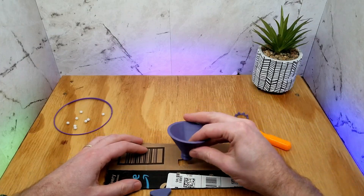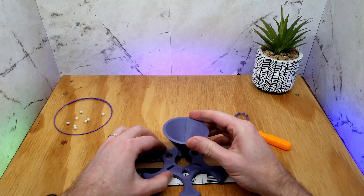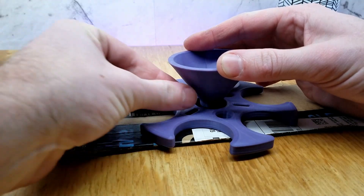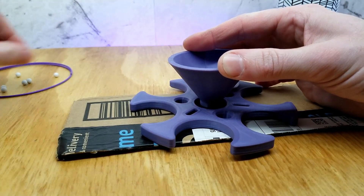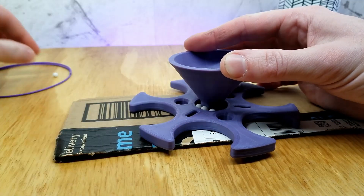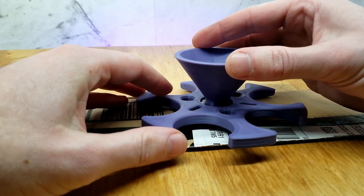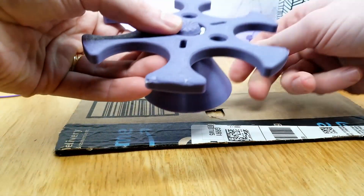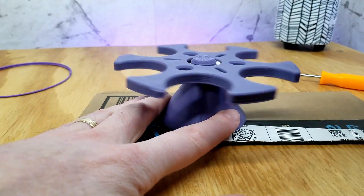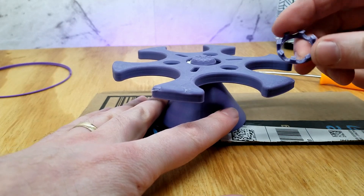The cardboard here is just a fixture to get the balls into the raceway — I struggled with this a little bit during the assembly of the first fidget spinner. It allows the center piece with the extended spinner top to sit below the surface so that the raceways are on the same plane and the balls just fall into place. It's pretty much impossible to get it together without it. Once they're all in, push the inner and outer races to be concentric and it'll just stay together enough to flip around. It spins great just like this, but it will come apart if all the balls fall into one side — believe me, it's happened. So I need to get the ball cage in place to keep them separated.